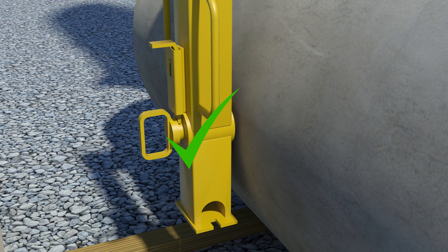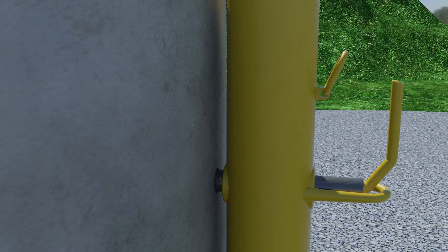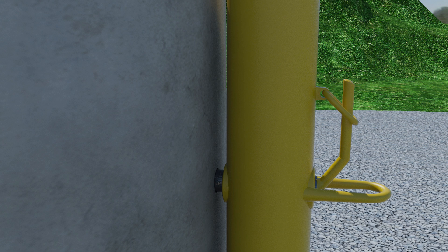While inserting and closing the lifting plug, you should not hammer the latch. The locking mechanism is designed so that you can operate it manually. The lifting devices are produced by several manufacturers with different functionalities and assembling dimensions — ask your supplier for instructions on the use of the device.